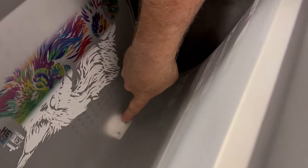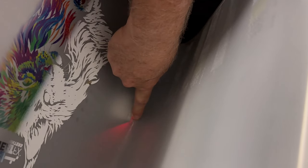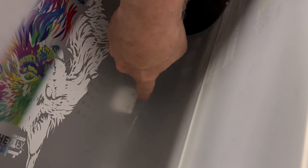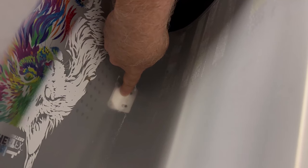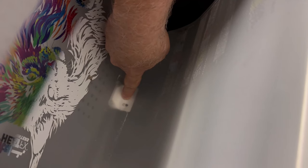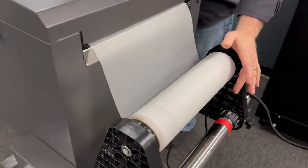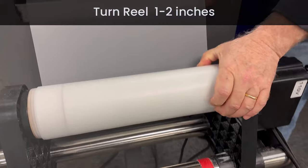If you see in here, this piece that's sticking out right here — it's kind of a little ledge — and underneath there is where our laser is at. You see the red around my finger? That's where the laser shoots across and gets tripped. However, this is a pretty good ledge, and sometimes powder builds up on the film and catches back here. So what's happening is the printer is pushing forward but there's no take-up from the back because the film isn't dropping down to the laser.